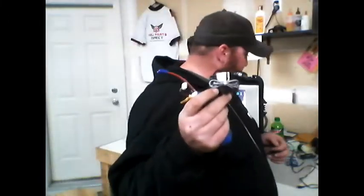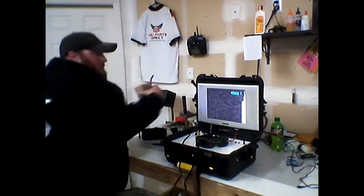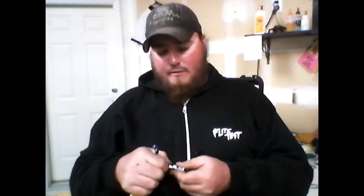I just picked this up last night from Hobbytown. This is the Fat Shark FSV 1601 transmitter. The camera doesn't come included with it, but that's the transmitter right there, and it has a circularly polarized antenna built into it, which is really cool. So I built a little FPV backpack that I can easily switch out from a boat to a car to whatever, and leave my big system, because this is only, I believe, the 25 milliwatt transmitter. I leave the 250 hooked up to the 350QX.